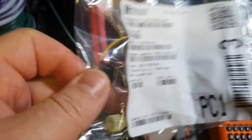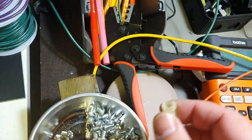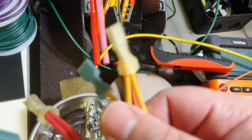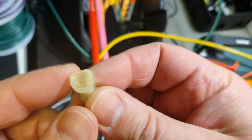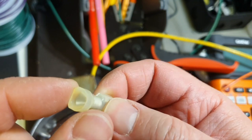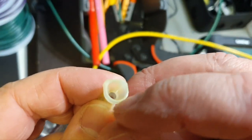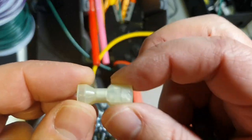It is that one, the brand terminal that you can find on different kinds of brand electronics, like from Blue Sea Systems. They supply it, for example, here. And take a look at two cables. You can only crimp it correctly with their tool. Why? Because they have this big plastic here. Why do they have it? Is it marketing? No, you have seen two wires. You may combine even three or more, and you need this space for insulation. So you have a special terminal for this, and that's good.